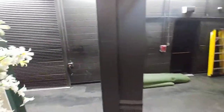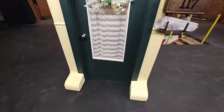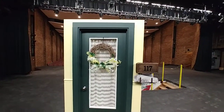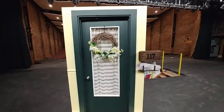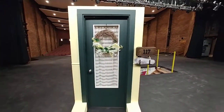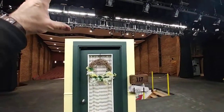You could cut it open yourself — do a full light or half light — rather than buying a specialty door. This is just an interior door. I certainly wouldn't hang an exterior door or spend a lot of money on it. The lightest weight door is going to give you the easiest time overall. Storing it on a smooth floor, upright and not twisted, is important — that's what happened to this one in the first couple of years. The hole through the top is partly a result of that.